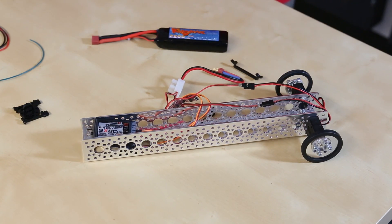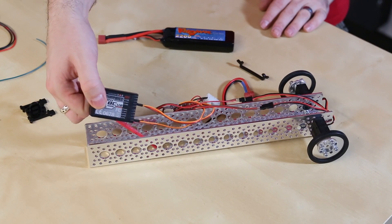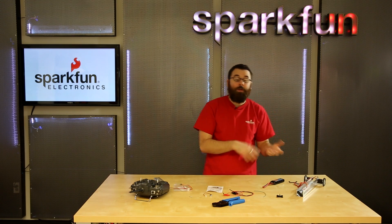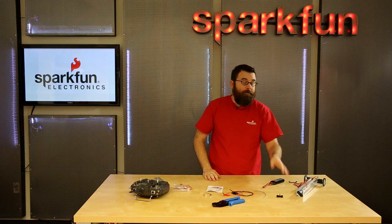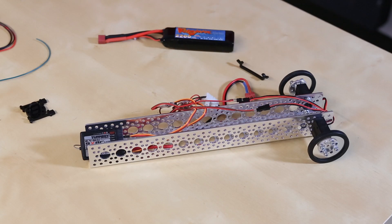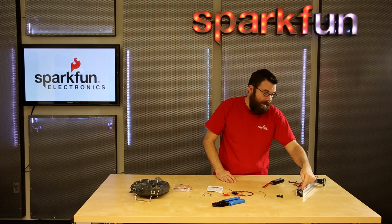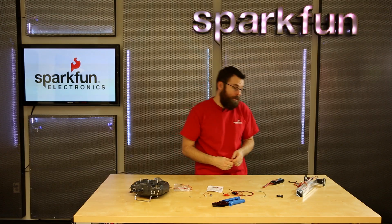This is all you need to do for a basic robot using one of the standard RC receiver modules. Now if you don't have an RC receiver module or if you want to use this with Arduino, you're in luck. The Arduino can very easily emulate these RC commands using the servo library. This outputs the same signals you would use to drive a hobby servo motor, so if you just do your basic servo commands, you can feed directly into the speed controllers and control the speed that way.